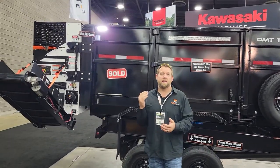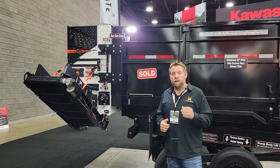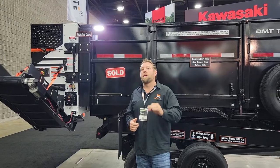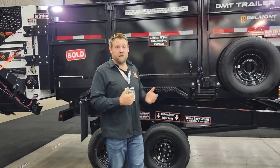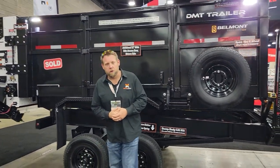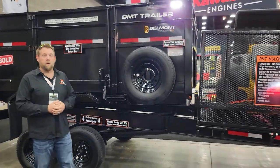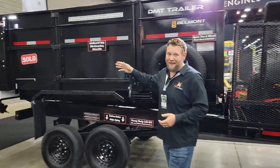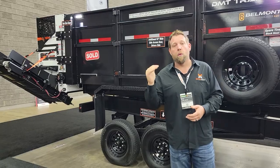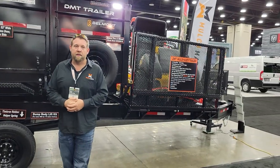Took a standard stock DS-1000 Mulchmate machine, and I wanted to make a trailer that was absolutely perfect — it would improve your business and allow you to get more jobs done quicker with less people and less headaches. So here we are, GIE 2021, and this unit has been a huge, huge hit. Real simple specs: this unit is a 12-foot body, three-and-a-half-foot tall walls. The floor is 10 gauge thick material and the walls are 12 gauge thick material.